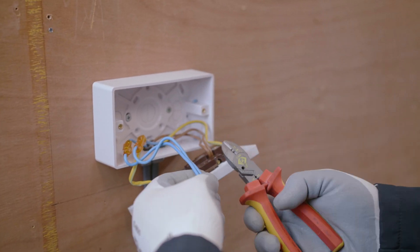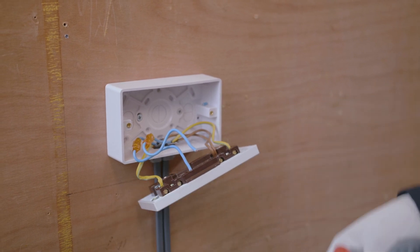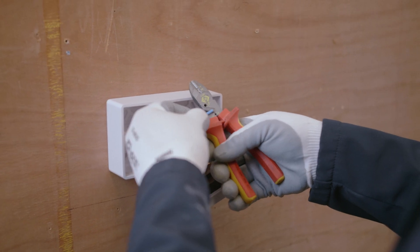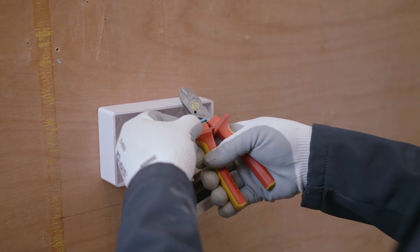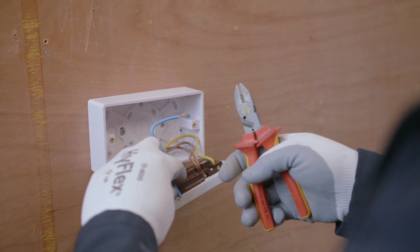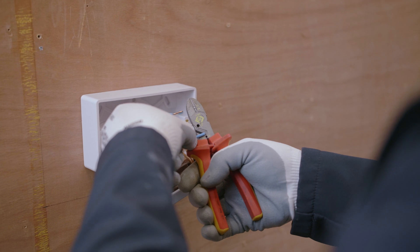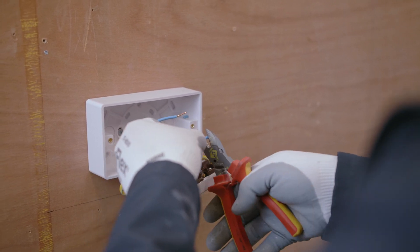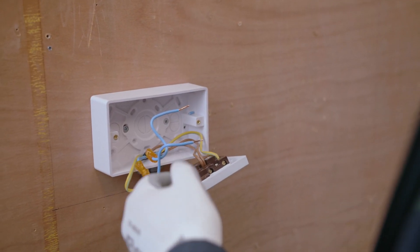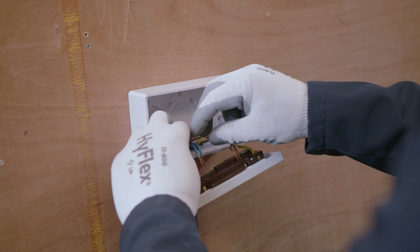Position these back so they fit nicely into the back of the socket. Put a nice bend on them, because what you want to achieve is just a little bit of extra wiggle room so those cables are not under any stress. We'll re-terminate both the line conductors and the neutrals, redress them as we've done in previous videos. Remember when you are tightening them up, just make sure you've got them pushed all the way in and just tighten them up.